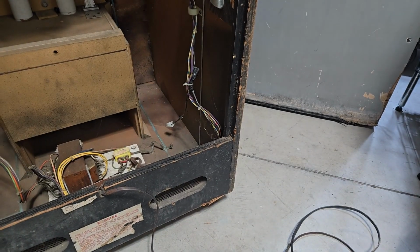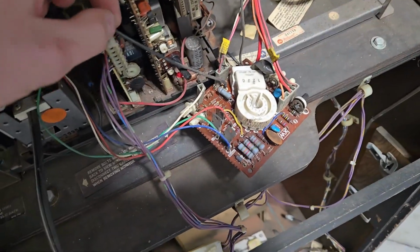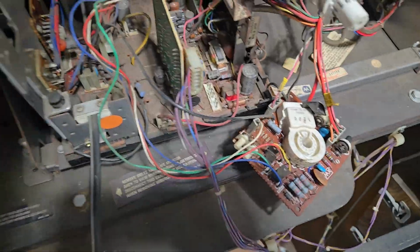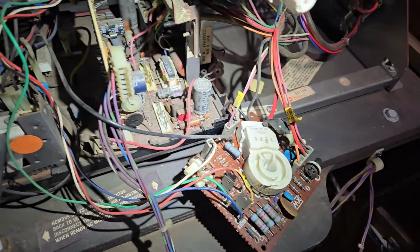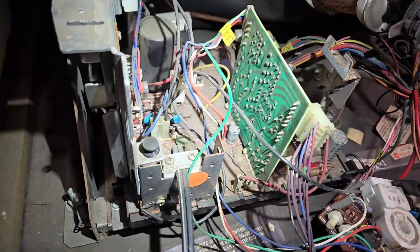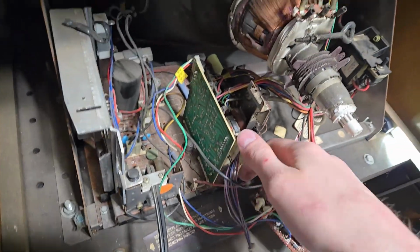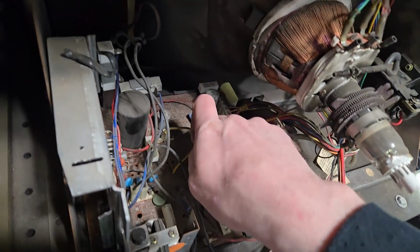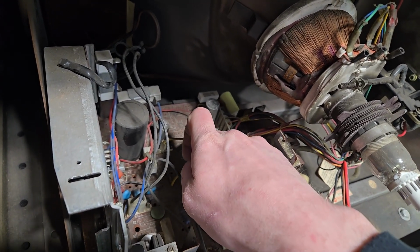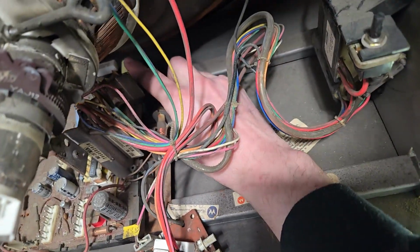Holy shit. 3 amps on the line voltage. What smoked? There's something that smoked on this board. It's not like I even did anything to it. I just took it apart and plugged it back in. That thing was smoking good. Was it that resistor there with the ceramic thing around it? Whatever smoked is bound to be hot still. It's not the capacitor I replaced.